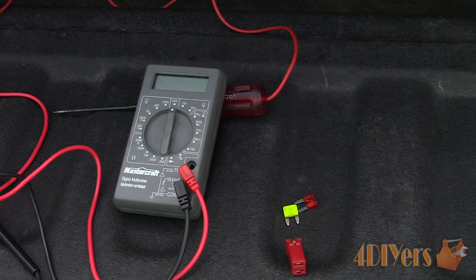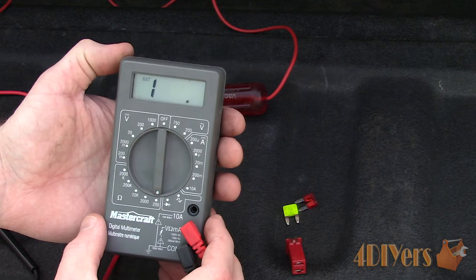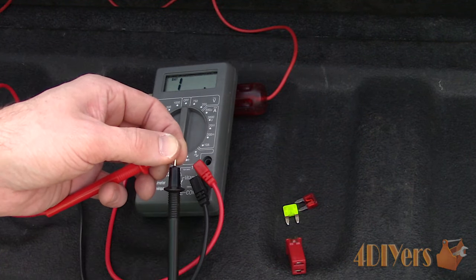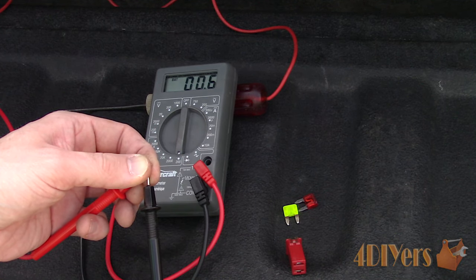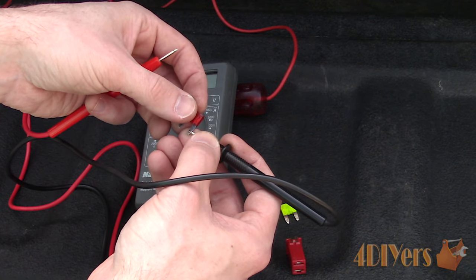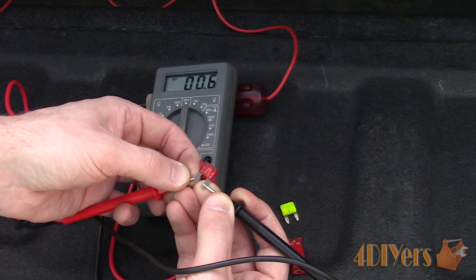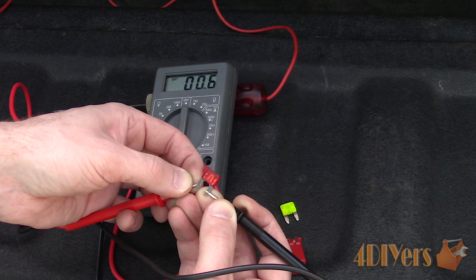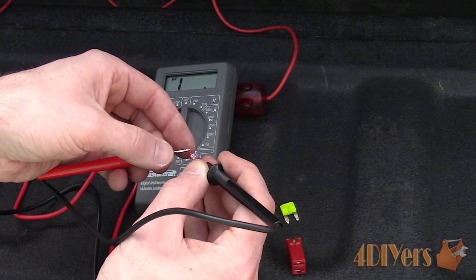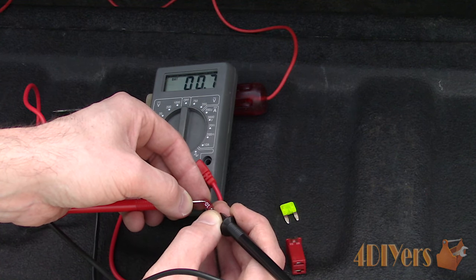First using resistance — set your multimeter to the lowest setting. Touch the probes together to ensure it's working. No value means we have an open circuit; when a reading is shown, that means we have a connection, so continuity or an uninterrupted connection. We have a reading of 0.06 ohms — there is a very small amount of resistance which may mean dirty test probes. Testing a good fuse, touch the probes on the spade terminals. Which probe connects to which connection doesn't matter. We do have a reading which means a good fuse. Just showing you from the top terminals, this would be the same test as you're using the same connections as they're part of the same conductor — and as you can see, we do have a registered reading again.